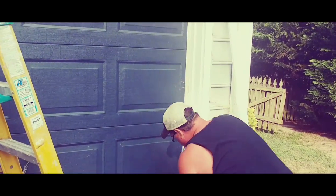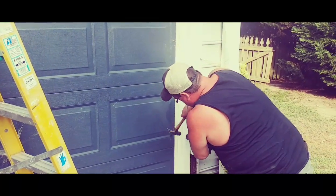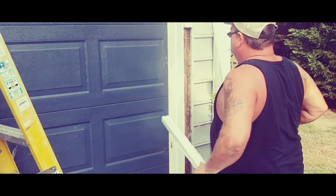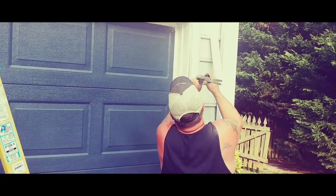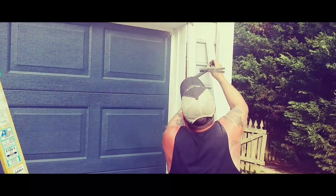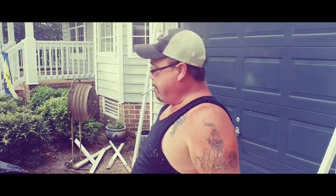Do everything at one time, so you're not going back and forth changing things, you know what I'm saying? So you're going to pull it all off at one time, shoot them all on at the same time, pop them all at one time. That way you're not picking up your nail gun or your caulking gun and putting it down over and over and over again. Now, we'll go through and clean up any nails that might be in there.